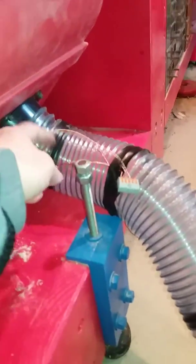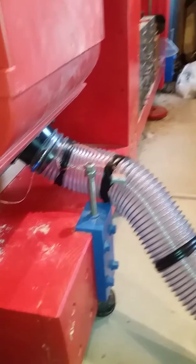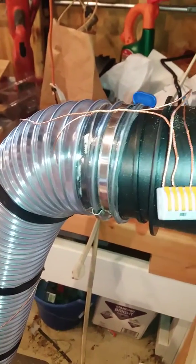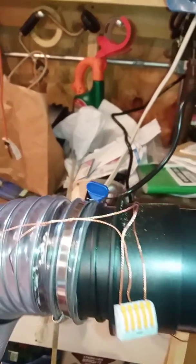If I have to open things up or take off the hose, it's just a snap — left myself a little bit extra. This way I can take the hose off real quick if I have to without needing any special tools. Did the same thing on this end here. I grounded the other end to the body of the collector. Here's where it can disconnect — just a flip of this lever here, break this connection, without damaging anything I can take the hose off and move it out of the way easily. I'm going to additionally run one more leg, a dedicated grounding run, just in case, right over to the box.